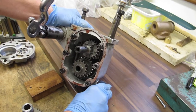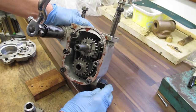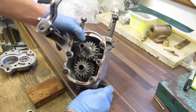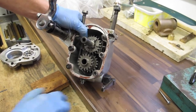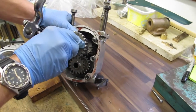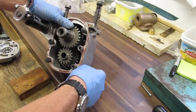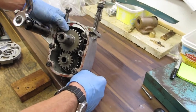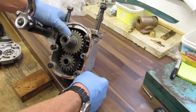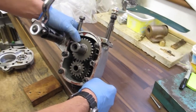If the gear is then extended further forward we would now engage top gear. Top gear is not on the box at the moment, but here it is. That would normally be sitting there and as the gear carriage slides forward it engages so that we have top gear. And that is it.